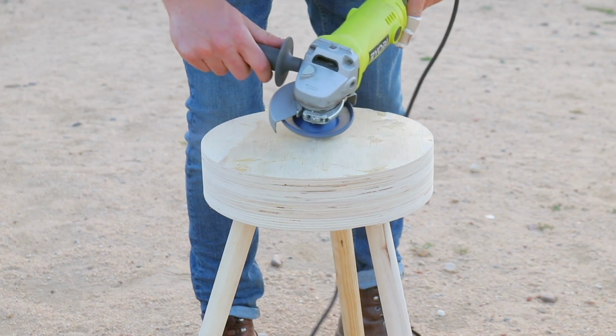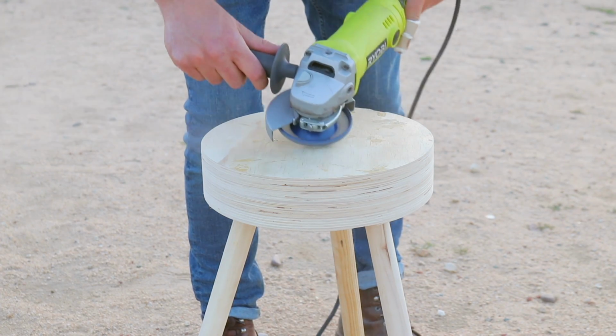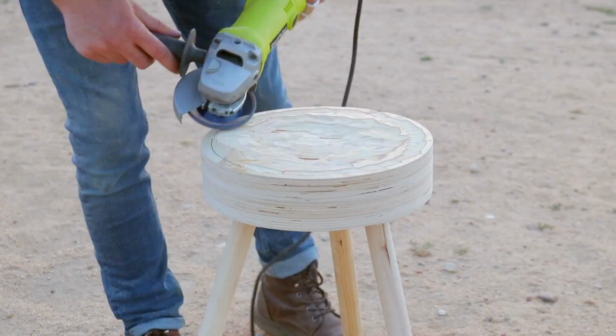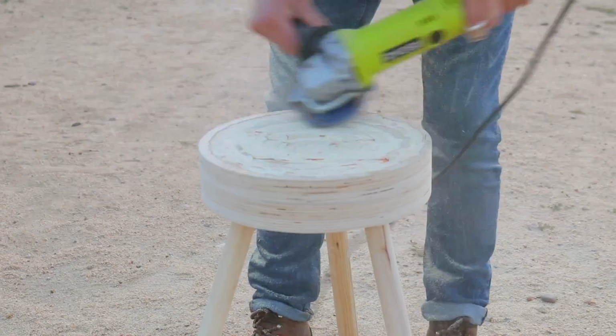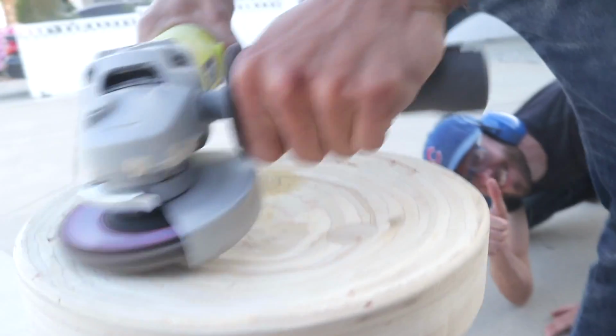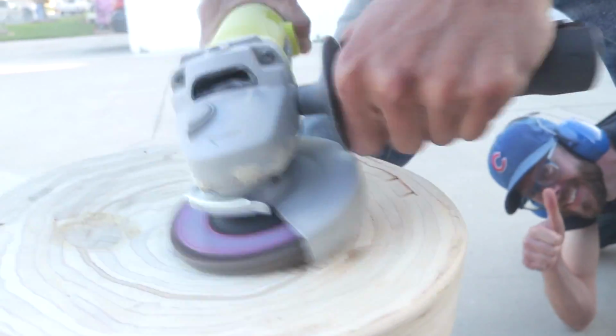If you've seen my channel before, then you've probably seen a little bit of power carving. Typically, I either use an Arbortech turbo plane or a flap disc on an angle grinder. But we recently picked up these abrasive discs from a company called King Arthur, and they'll be linked in the description. We did the rough sanding with that and then switched to a 120 grit flap disc.